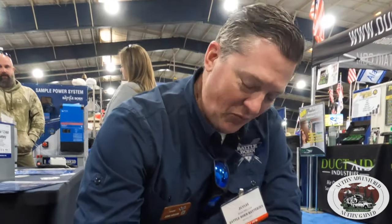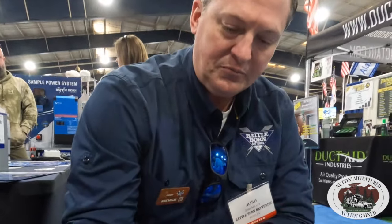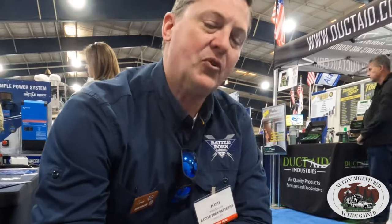The battery disconnect will obviously disconnect this system from the rest of the supply. Before you educated me, I didn't know what a battery disconnect was, so not everybody might know about it. If you flip that, it turns the batteries off — it kills the whole system. When we're done camping and ready to shut everything down, we turn this off and walk away. We don't need to break into the battery system or pull the batteries out. Turn it off, walk away, come back in six months to a year, and you'll have barely lost any stored power.